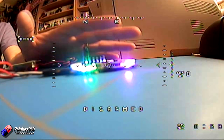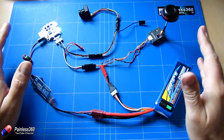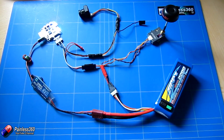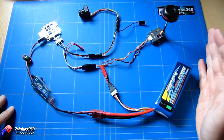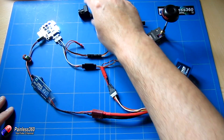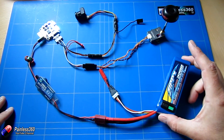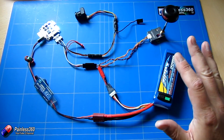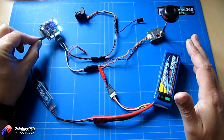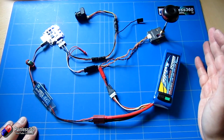So that's how you configure and set everything up. If you're interested in this board, hopefully that makes it slightly easier. It really is plug and play — you set it up and connect it to CleanFlight and configure it exactly like a Naze 32. But of course you've got all the on-screen display stuff already built in. All you need to do is connect the video in and ground to your camera, video out and ground to something like the Quantum Elite video transmitter, and you have a flight controller and FPV on-screen display all in one little board. I'm impressed — this is something I'll probably pop on a quadcopter and use to fly.